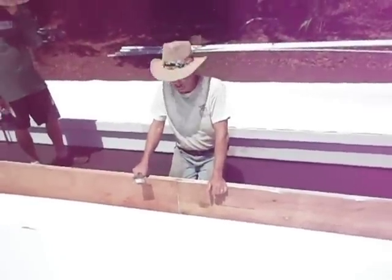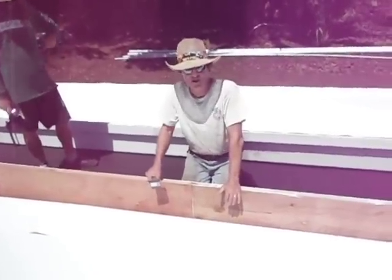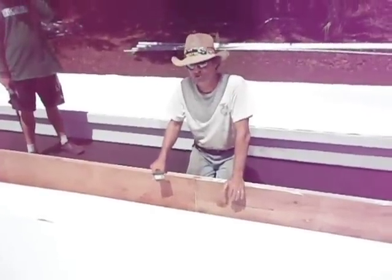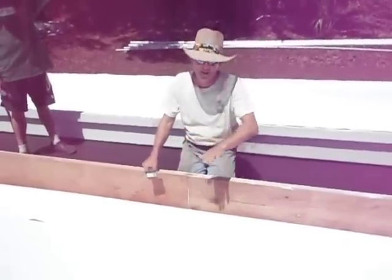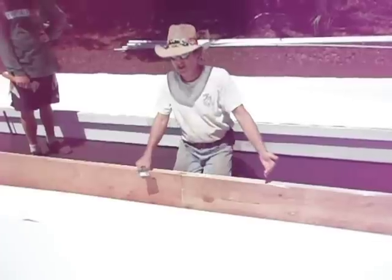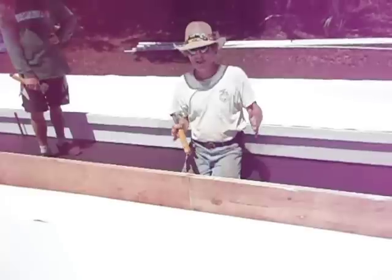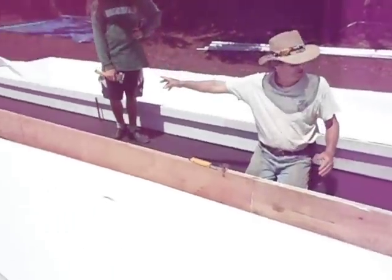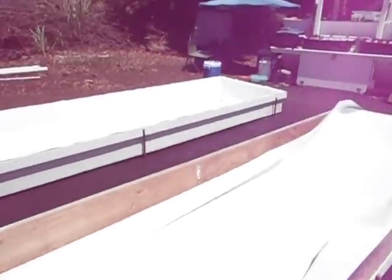Now we're going to cover beginning to put the trough liner in. Where you start is you cut a piece of trough liner that's three feet longer than your trough. If you have a 32-foot trough, don't make the mistake and cut the trough liner 32 feet long, because then you won't have enough to go up the end of the trough and over the top. What we've done is allow the trough length — 32 feet here — plus another 3 feet, so that we have a total of 18 inches excess at each end. We've laid the liner out so there's 18 inches hanging over on that end and 18 inches hanging over on that end, and I'm right in the exact middle of the trough.